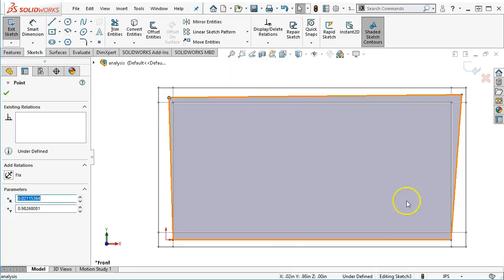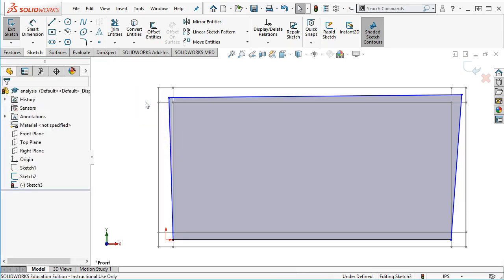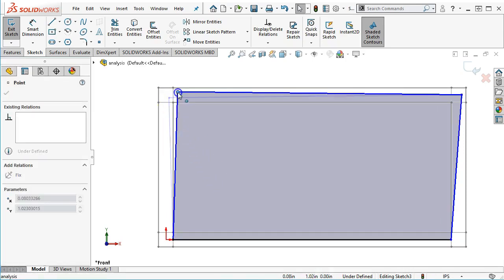All right, and this being at the low side of the tolerance, our least material condition at the base, this could also be at max and going the other way, but we pretty much have to pick one to start the analysis. So when we think about it, we've made this side flat, and so this is holding our plus or minus dimension, as well as having the flatness of 2 thousandths. So its tolerance zone, in this case 5 thousandths, we're right there at perfect form. So if I was exactly perpendicular, I would be at least material condition, and I would be using up the tolerance on the other side.